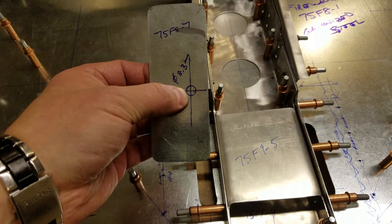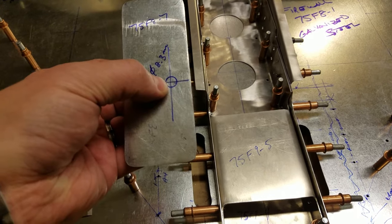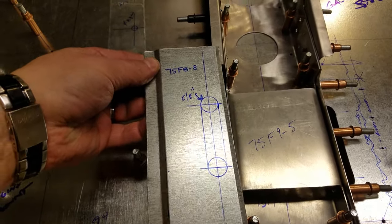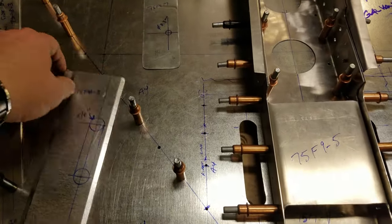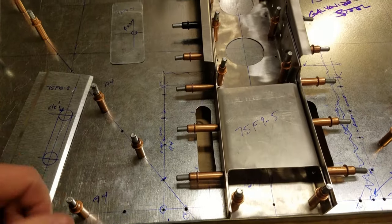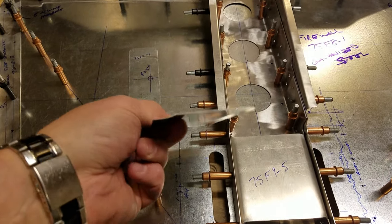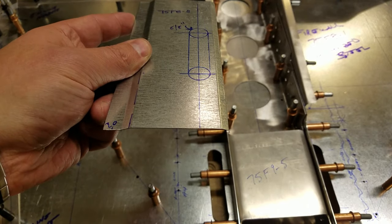The hole in the slide is very small — just big enough for the steering rod to come through and connect to the nose gear. The wide slots in both these pieces allow for the rods to move back and forth and up and down freely. This slide cover goes up and down in between there, so you get a three-layered system. But in order to accommodate this piece inside the mechanism, you have to put what's called a joggle in the material.